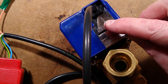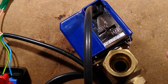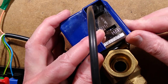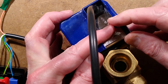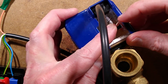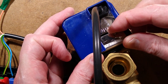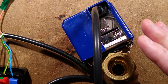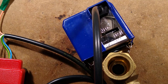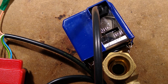This is an override that you can use to put it into a mid position. You can actually physically override the valve by pushing this up — you hear the motor running, pulling it down — let it go back and it latches. There's a sort of overrun on the motor; I'll just hold that in there for a moment until it's settled down. That means you could actually override the valve with power off. But watch what happens when you power the valve up again — it automatically releases itself to go into automatic mode again.